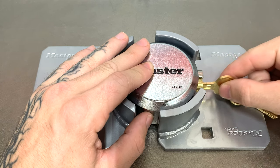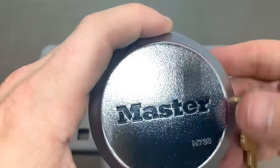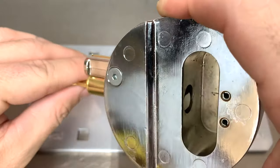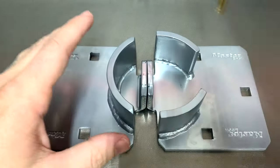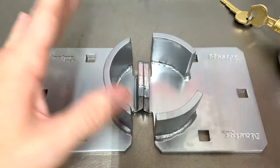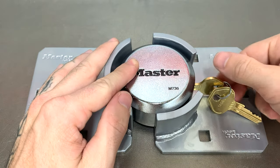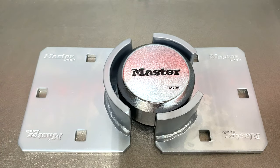To open and unlock it, you insert your key, turn it to the right, pull out the core, and you are able to remove the puck. To show what that's doing — you turn the key and as you pull the core, it has a pawl connected in the back so it won't allow you to pull it all the way out. That pawl aligns with these hasps. When the doors are shut, you pull the core out, turn it around, set it back on top, push it in, turn the key back to the left, and remove it.